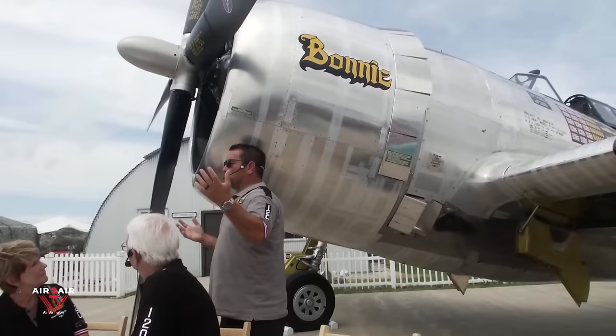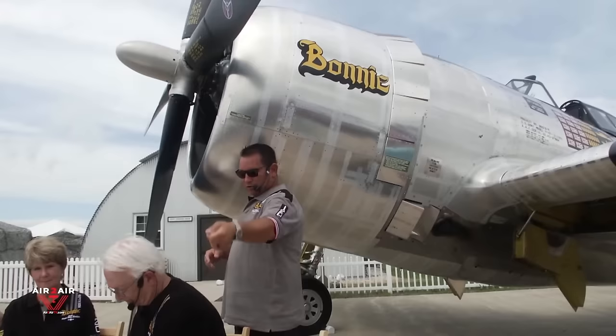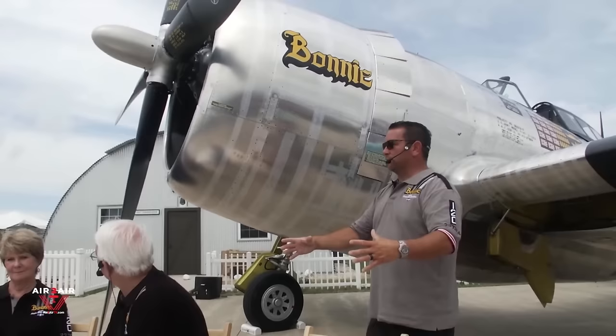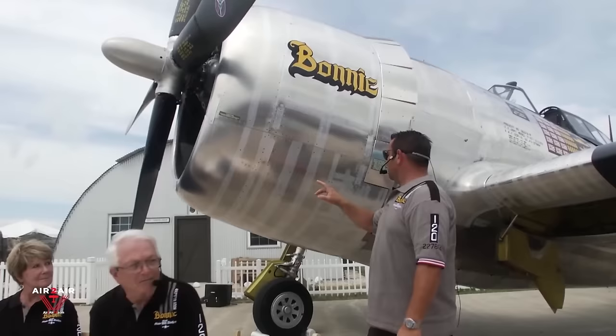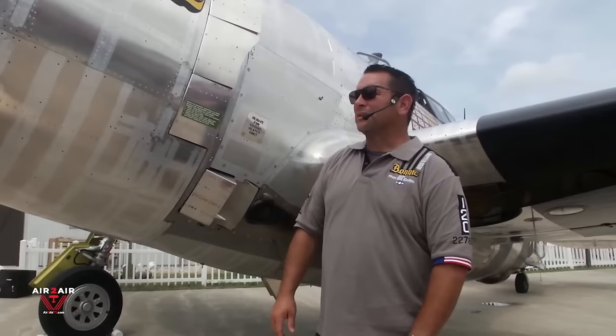Some of the Pratt & Whitney engines had a shifting capability, so you'd turn the blower slower down low. When you get to high altitude, you'd shift it, go to the granny high gear, and it would turn faster to compress more air. When they designed this airplane, they just put a secondary blower back there, run off the exhaust. So you've also got two ducts for the oil coolers, which come out here. What was the horsepower? Probably 2,300, something like that? 2,324? Okay. Wet. Yeah, so 2,300 horsepower, something like that.